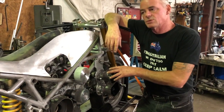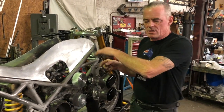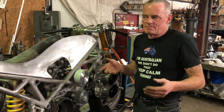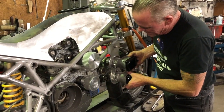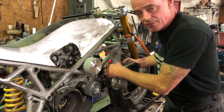We got rid of the fuel injection, so I could run a separate ignition system off the crank trigger with the fuel injection, but that's too simple in a difficult way. So what I did, I made up this bracket and I've got these distributors — you can index them, retard and advance them as the engine's running. They're running off the two front cams.